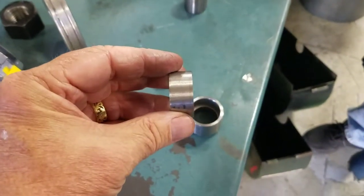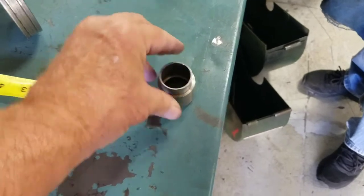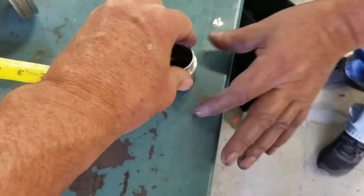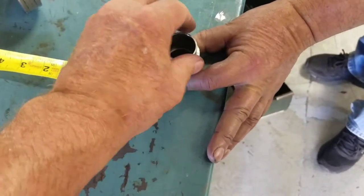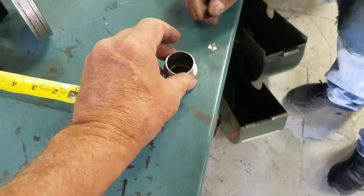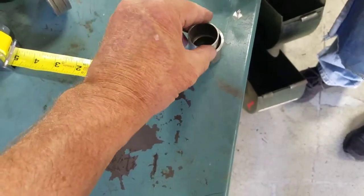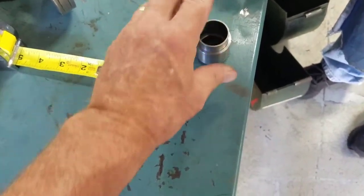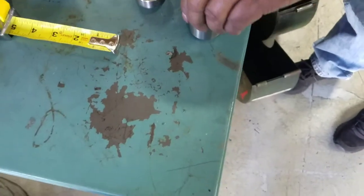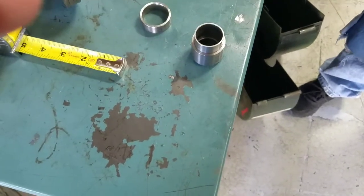The bushing itself has got an ever so slight taper so that one side actually fits in better than the other side — that side fits in and you can kind of feel it, but frankly it will go in both ways. Because it's an interference fit, it restricts or restrains itself as it goes down, and that allows it to keep the gaps without somebody being able to pry it either smaller or bigger.